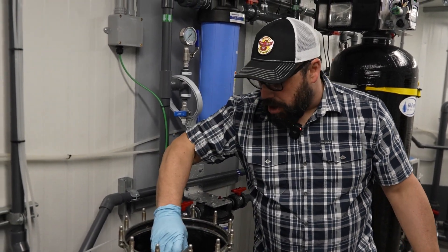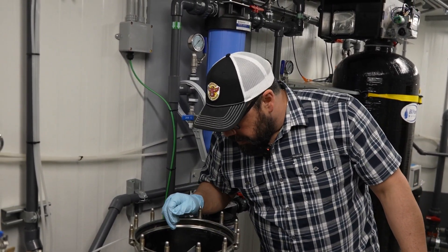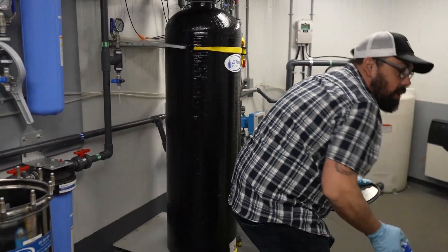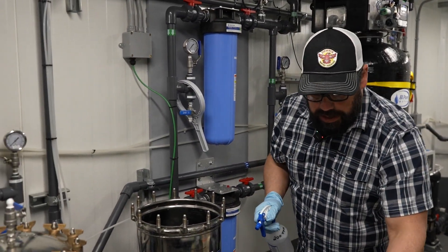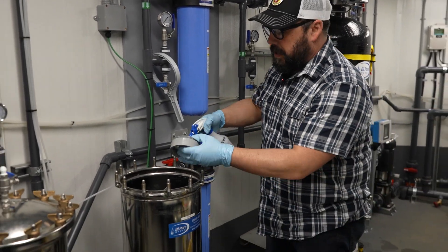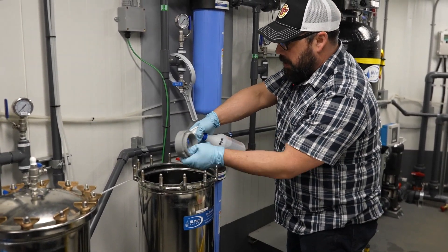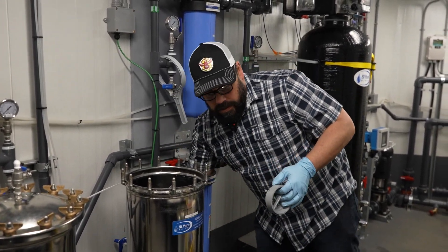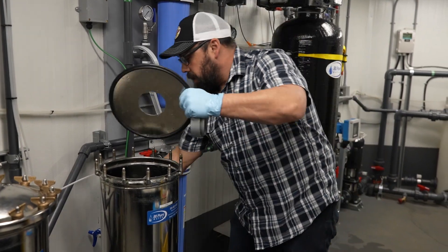Look for any damages on your drop pipe here in the center. Once it's cleaned up, you would disinfect all these parts. I prefer to disinfect things into the canister — so you control your spray, spray down the side of it as well. Make sure you get all your pipe and spray this down as well.